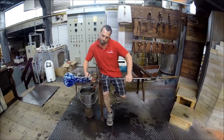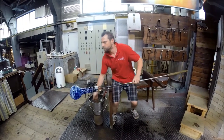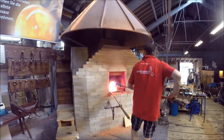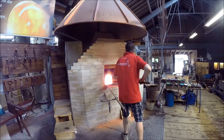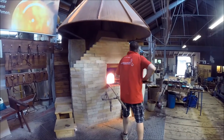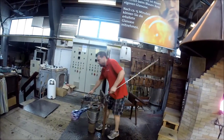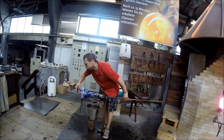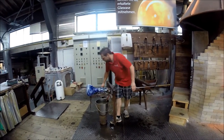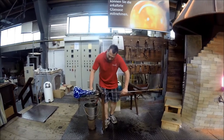Now it's preparation to, in a couple of seconds, cut off the vase from the glassmaker's pipe. We still have no stand yet — high surface tension means that when you blow in, glass always wants to turn into the form of a ball, the lowest surface as a geometrical body. Now heating up the so-called top side, which is later going to be the stand. That orange color is the temperature indicator for the glassmaker — there is no instrument; they simply read the glass by the color of the orange to know how hot it is and how many seconds they have left.